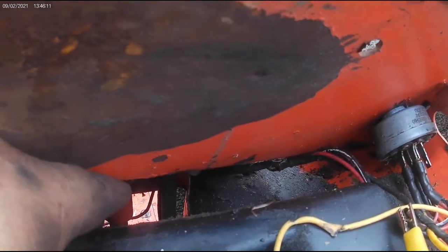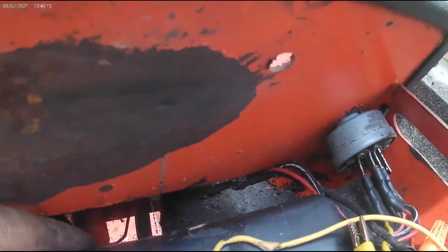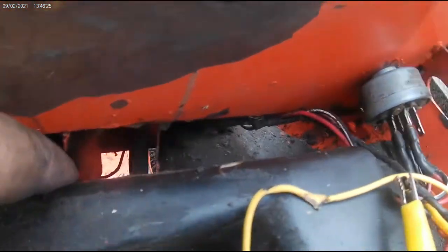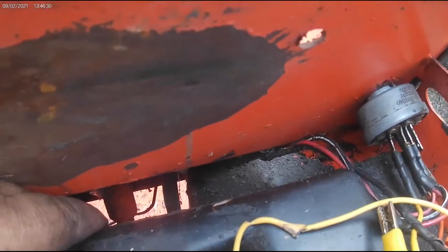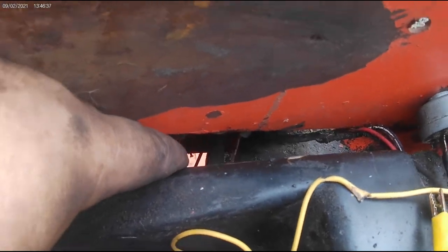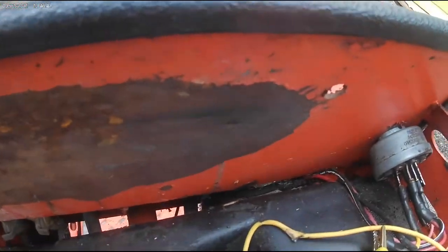and that's going to be hard to see, but down in here there's a piece of plastic which is called your neutral safety switch, and there's a rod that rides on there that's welded to the lever. There's going to be two nuts, and you have to loosen those nuts up, take them right off. Usually you can get a flex head ratcheting wrench in there, or super long 90 degree needle nose pliers. You can hold on to them either way, and you got to be able to pull that plastic piece out, and that will allow the handle for the travel control to move up that much more,